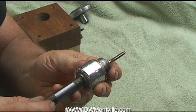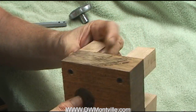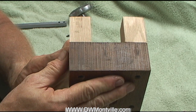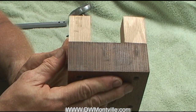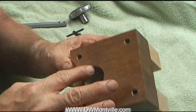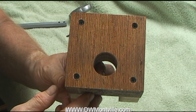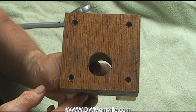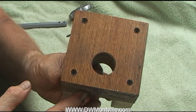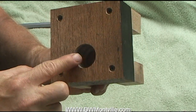The next thing I did was make this little block. This block is made of modeler's mahogany — you can see it's a laminated construction and it's very stable, which is why model makers used to use this stuff. If you're going to use wood, you'd want to use something really stable. I probably wouldn't go with a 2x4 because it's probably going to warp as the humidity changes. Use something like an exotic wood or laminate some wood like this so you know it's going to remain stable.